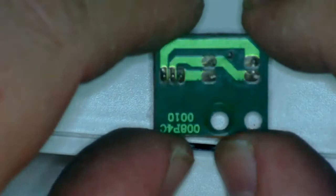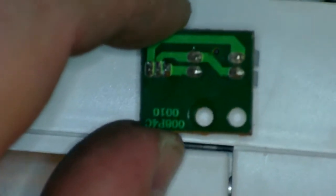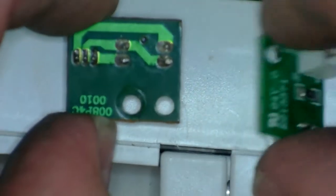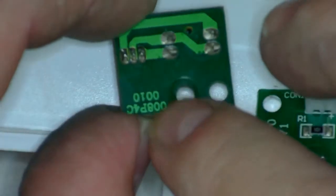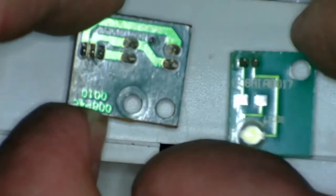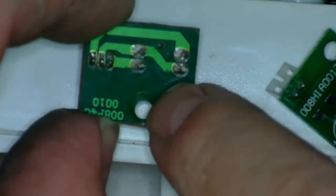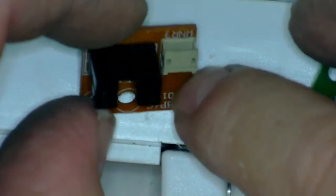And just a little bit of feedback. Looks like whoever designed this board took a different tack than the guy who designed the last one. Right, I've got the last one here. See how we've got parts on both sides of the board? Silk screen on both sides of the board. That all costs money that you can save. So see here, they didn't even use silk screen. They used copper for all of their lettering. And to me, whoever designed the board on the right is much less experienced than the guy who designed the board on the left. Put all the components on one side, got rid of the silk screen layer, got rid of the solder mask layer, right? Didn't need it. Forget it. Here we've got our silk screen and, you know, parts, everything.